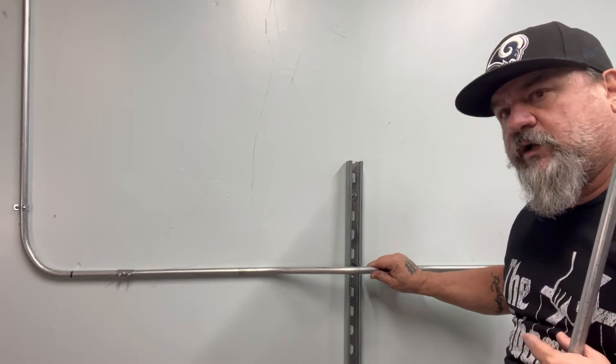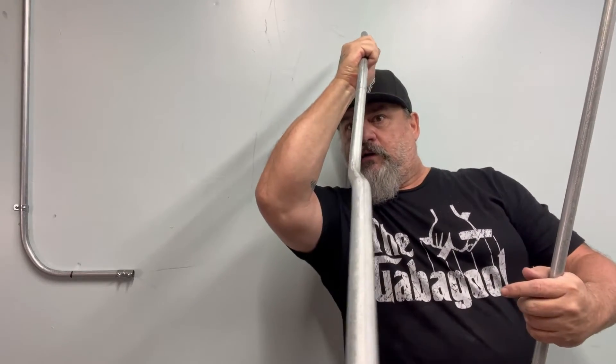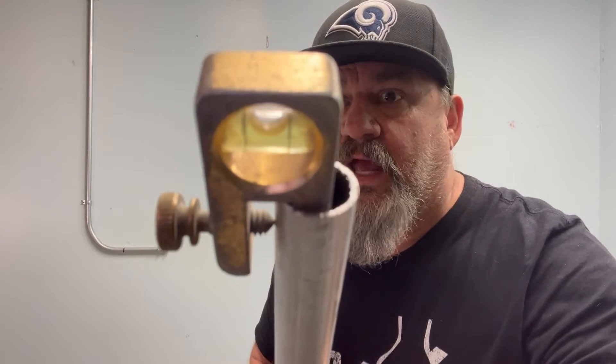Let me show you something about keeping the dog out of it — you can look down and see if you've got a dog or not. Let me show you a quick little tool. It's usually made for rigid pipe. This here is called a no-dog. If you start your bend, make it dead even, stick your bender in there and tighten it up — that's where you stay. Bend down, then flip it over 180 degrees for your second bend. Line it up, get it tight, and that thing will be dead on every time.